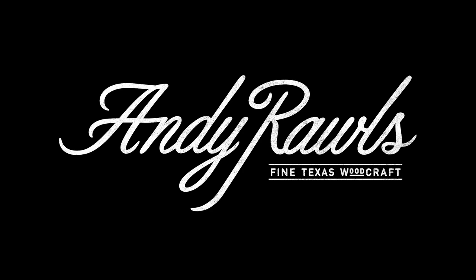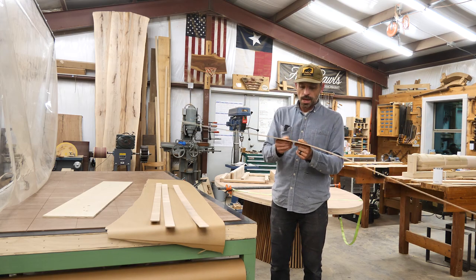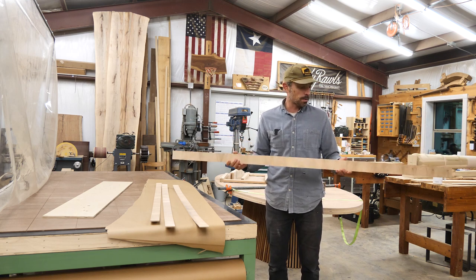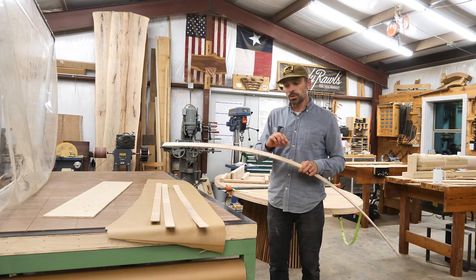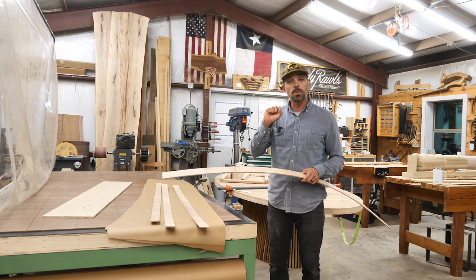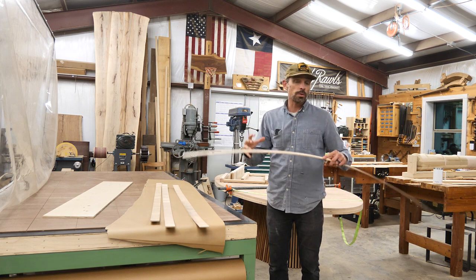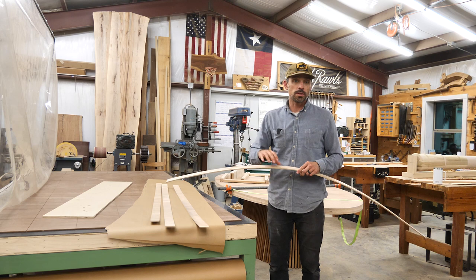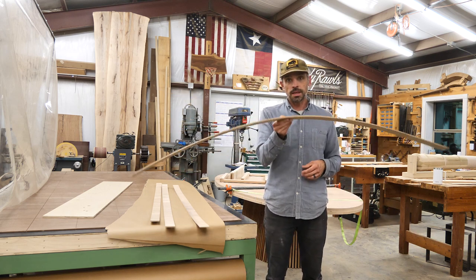So this is what I would call bendy board, shop made bendy board. And there's a lot of different ways to make wood bend. Most people are familiar with steam bending. There's also bent laminations where you take very thin pieces of almost veneers and you bend them around forms and you glue them and they'll hold tight to whatever form you bend them around once the glue sets. You've seen me do that many times on my channel, but I've never done anything like this.